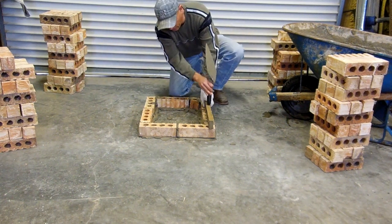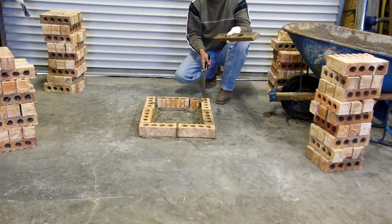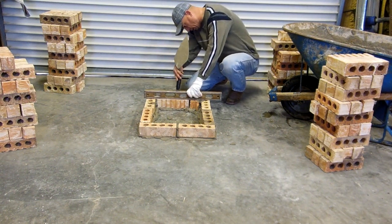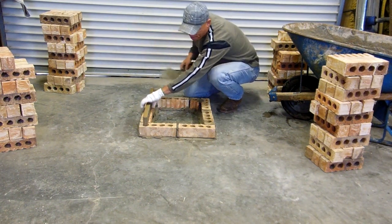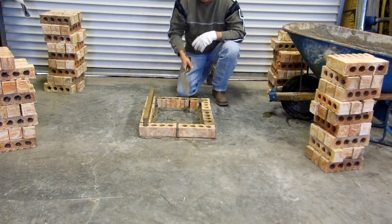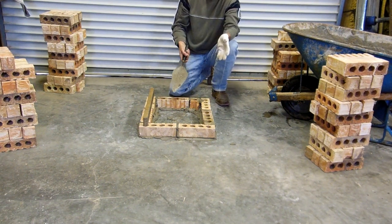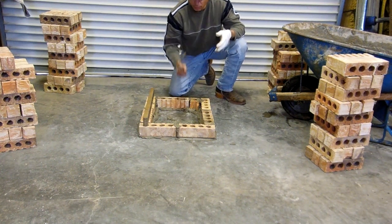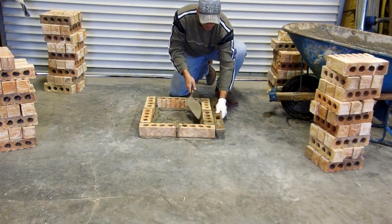And you just level it around. When you start this, you need to level one side and then both ends, like so. And then this side. The reason being is if you level this side, level this side, level this side, then go across the front, you can mismanage your bubble and end up having a little more room on one side or the other.